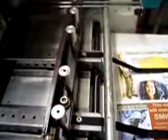Now we start the trimmer, the folder. Now the trimmer, all you have to do over here is set the backstop. Now these are your stop pins. Again, your covers are all off, and we always leave the covers off until we're done testing the machine. Right here you have your 4 stop pins.